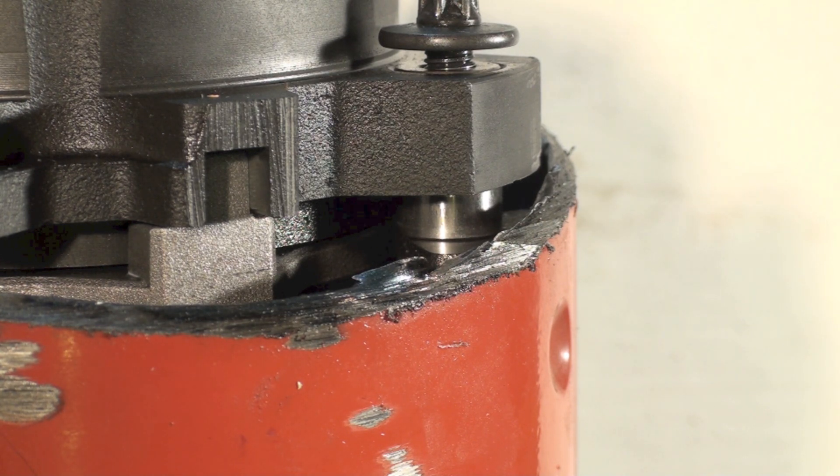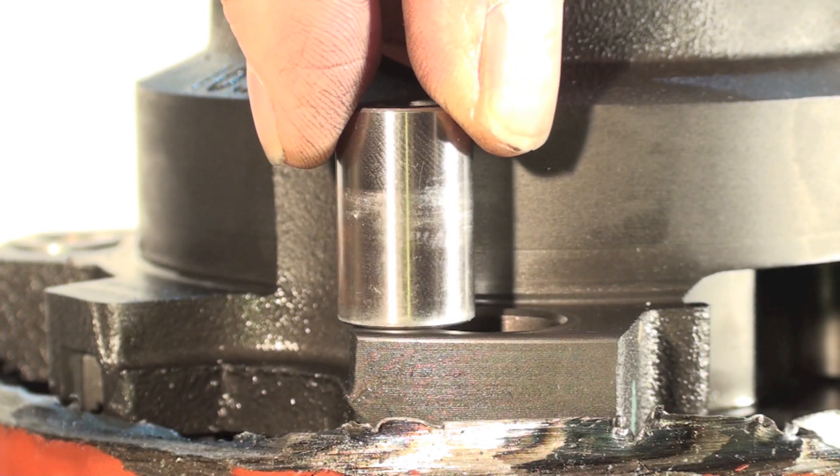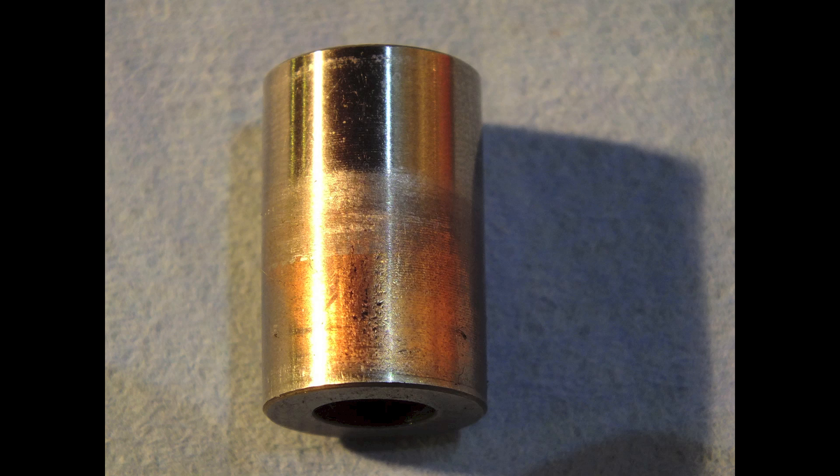That's kind of an explanation of the Copeland scroll. If you rotate this around you can see the heavy pitting on that sleeve, and of course the copper plating is going to reduce the clearance of that sleeve and could jam it. That's about all I know about these Copeland compressors — pretty interesting compressor, and pretty much the standard anymore is going to be a scroll compressor.